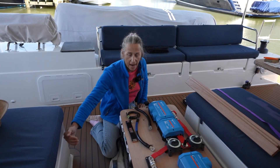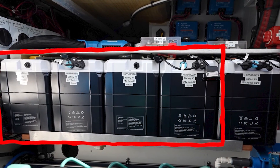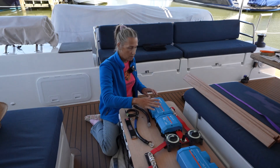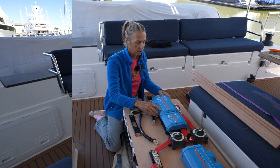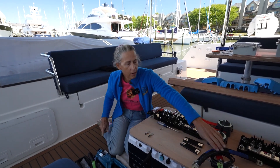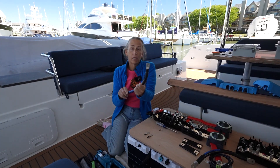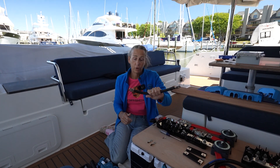When we're in the engine bay we're going to be accessing it from this side. The 12-volt will be on our far right, the 24-volt on our far left, and all the wires for the inverters are going to be going to the 24-volt. I want to show you what I've learned about crimping these connectors. These big four-aught lugs have to be crimped on very, very tightly. We can't have any resistance and we certainly can't have them pulling off the end of the wire — it's critical these be perfect.